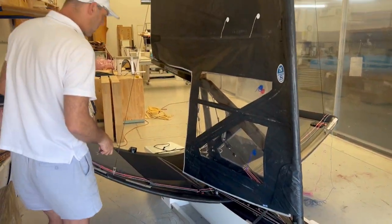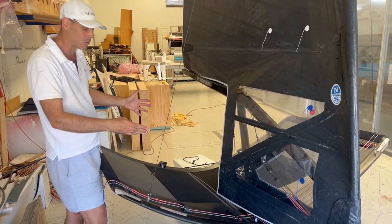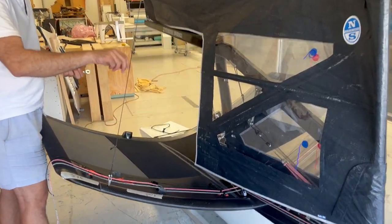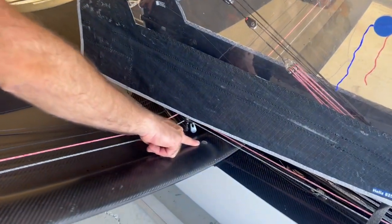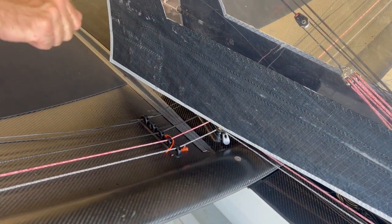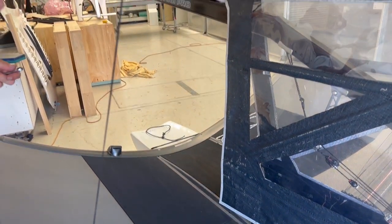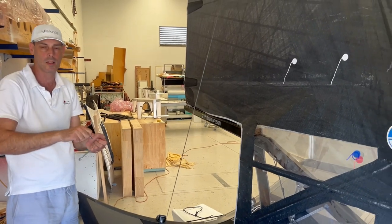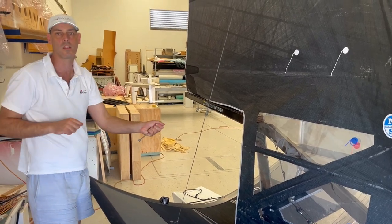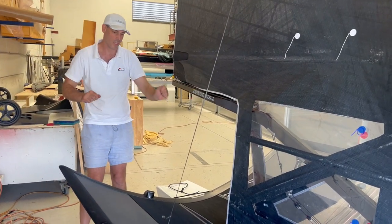In terms of wings — perpendiculars go on first onto the boat. There are four bolts that hold the wing bars together. Start the M8 bolts by hand first to make sure they go in nicely, then use an allen key to tighten them up. Turn them quite firm but don't try to go super hard — go firm but don't lever it and go crazy because you can damage the boat. Firm and tight but not ridiculously tight.